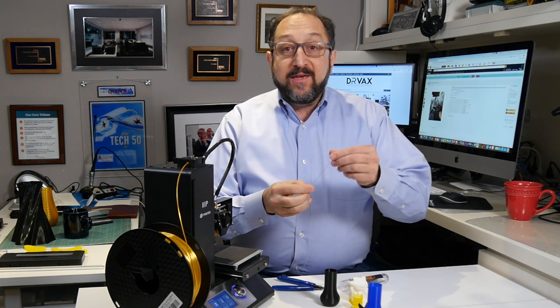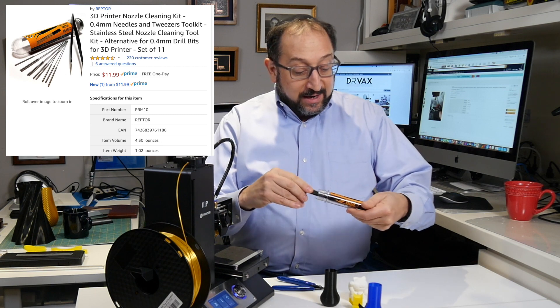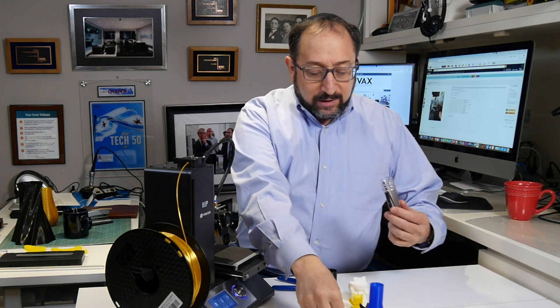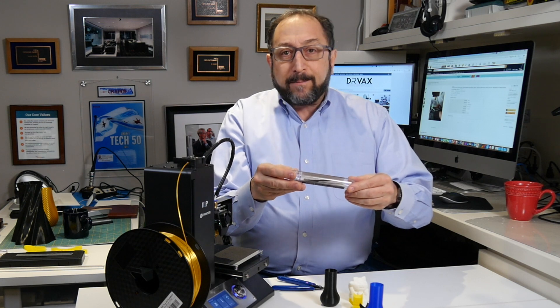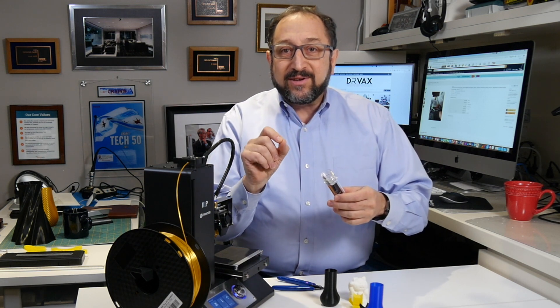To get started with this technique, you're going to need two things. You're going to need a diagonal cutter, and you're going to need to buy one specialty product — these are 0.4 millimeter needles. I purchased a package of these; it looks like there are about 10 in here, and it also included tweezers. I purchased these at Amazon for $12. Reptor is the one I'm using here, and it had very good reviews. These needles are the key to making this easy. You don't need cleaning filament, you're not going to have to take your nozzle off or disassemble your whole printer.